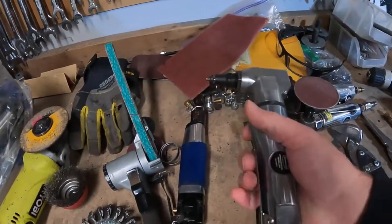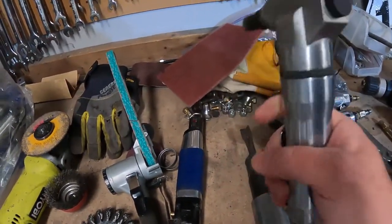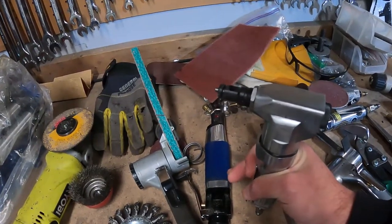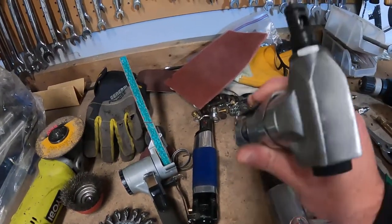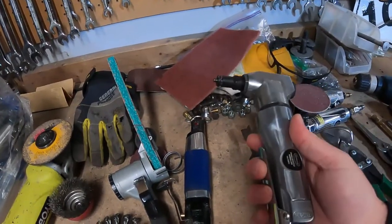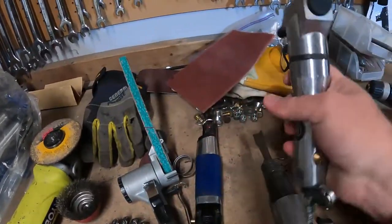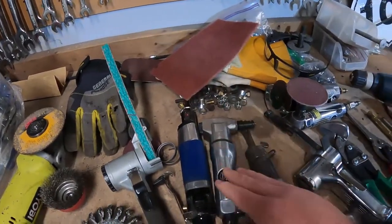Getting back to cutting metal, you've got a couple of different options. This is called an air nibbler from Eastwood — it's a phenomenal tool. The only complaint I have is it leaves these little chunks of metal that fly around the garage like crazy, end up in my boots, and I track them into the house and scratch up my floors. But it's great because it allows you to make intricate curves — you can cut pretty much any design you want in the metal.